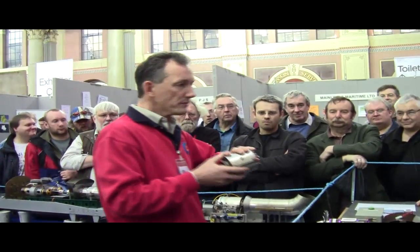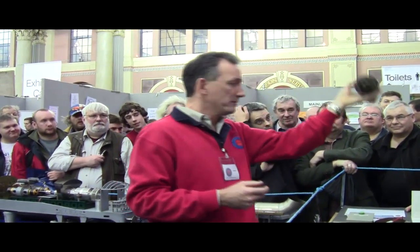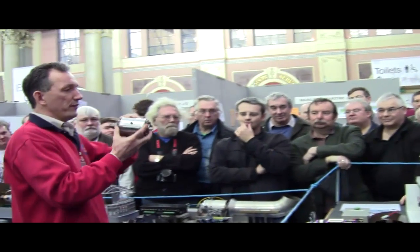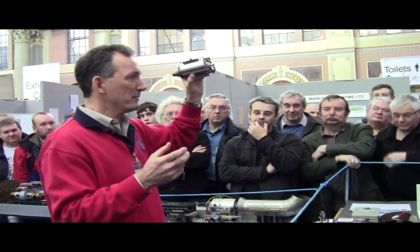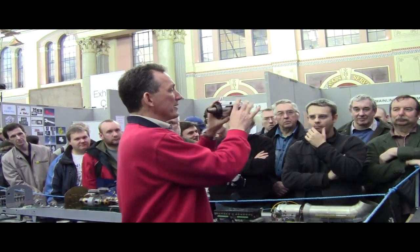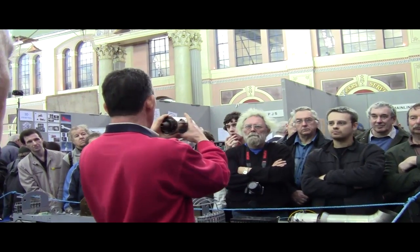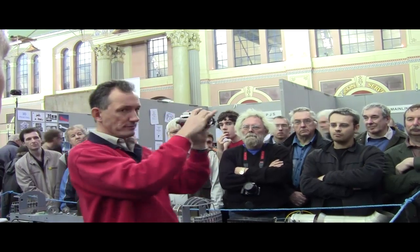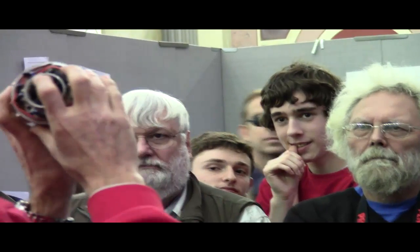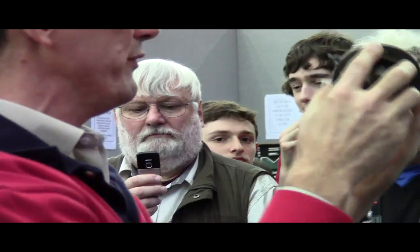It is powered by a gas turbine — the jet engine, exactly the same jet engine as this one — buried down inside the bodywork. For any jet engine, it has to be started, so let's go through the practicalities first before we come on to the locomotive. What we've got here is a gas turbine with a single-stage centrifugal compressor at the front end and a single-stage axial flow turbine at the back end, with a shaft connecting the two together — so there is one rotating part, a single moving part in this engine.